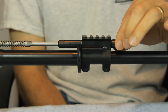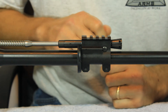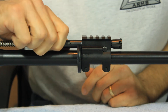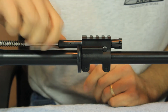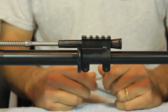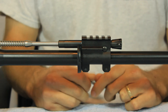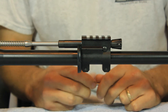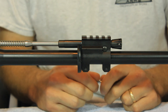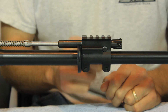We can go to our adverse setting and you hear the click again. Also, let me bring to your attention our exhaust port that's here. When I run the piston back you'll see it'll open up — that allows any excess gas and fouling to be discharged out our exhaust port. And then finally our last setting is even beyond an adverse setting — it gives you about 7% more gas than our adverse setting. Obviously that would be used for your absolute worst case scenario where you don't have any opportunity to take the gun down for maintenance, but you need to keep it running.